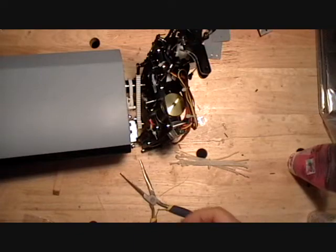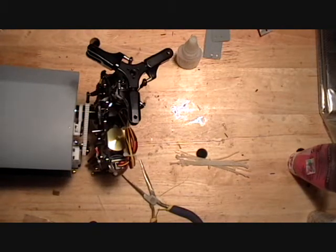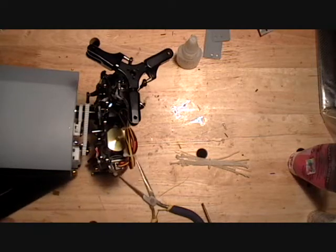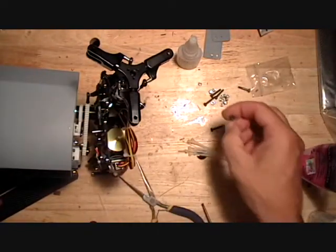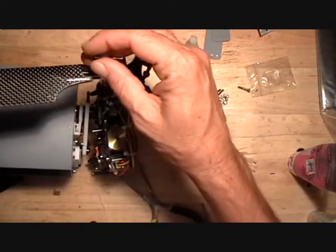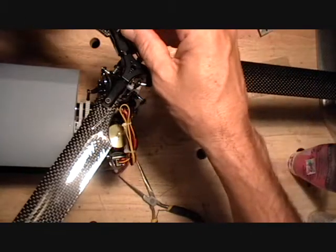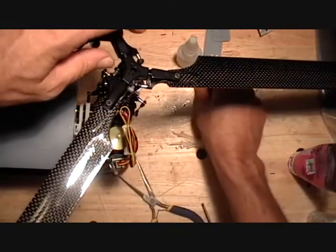Now the kit comes with blades. And they're in matched sets of 3, so you don't want to mix them up. You want to keep them in the set. We also come with the blade bolts. The rotors rotate such that the blade rotates towards the wing. So I'll just set these 3 blades in here. Then I'll put on the nuts.